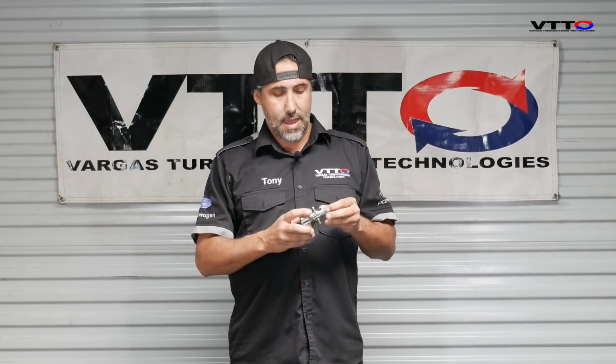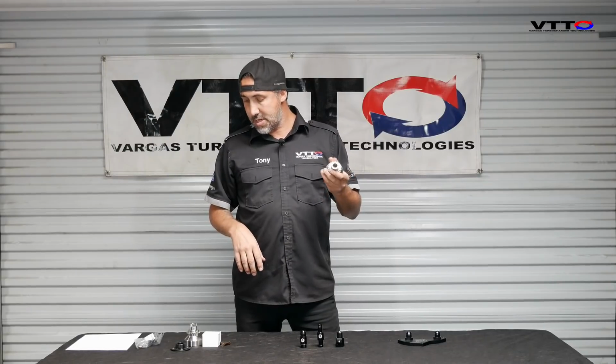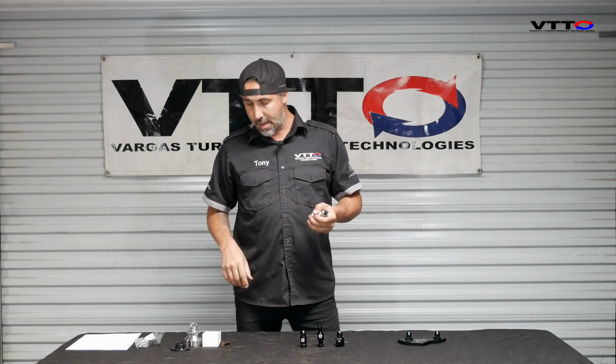We made a test rig where hydraulic pressure would spin a crankshaft. We actually sacrificed 2 crankshafts for our test rigs, and we would apply pressure and see how much it took to spin the crank on the hub. Our final design ended up breaking our rig before it would spin the hub, so then we knew we had it. So essentially, you press this in, it locks it to the crank.